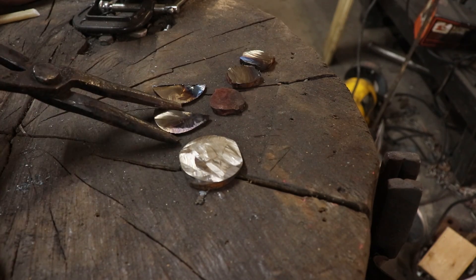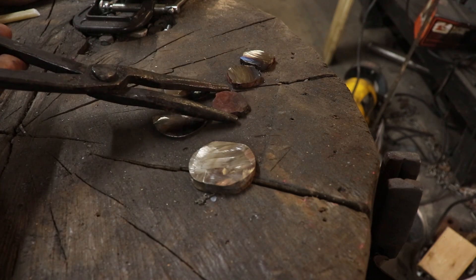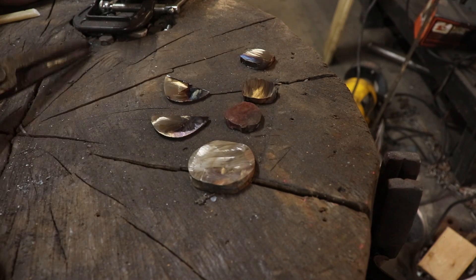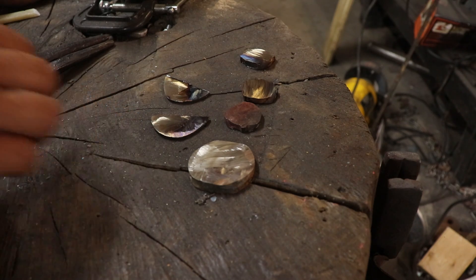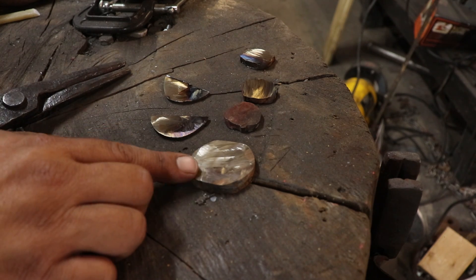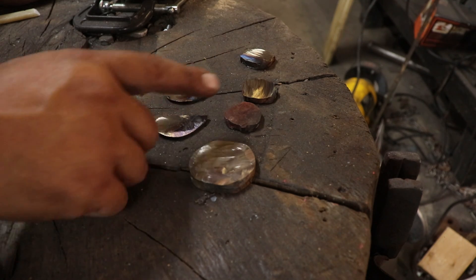I have these cut. I split the big one down the middle on one of the pieces; this one I left whole, which is a little inconsistent because I was using a cutoff wheel. These ones here I have pretty consistent — I have three of them. I'm going to bring these up to critical temperature, let them normalize out, then bring them back up and quench them in water, probably starting with one at a time. This big material I actually have some faith in because it's some sort of structural tension type rebar, not normal rebar, so I'm hoping it hardens out.